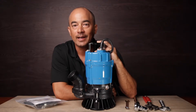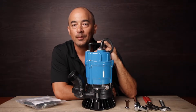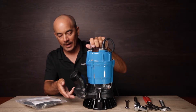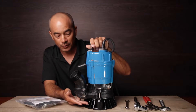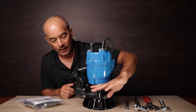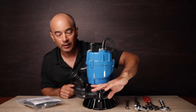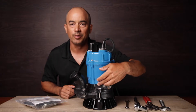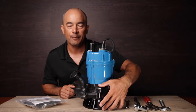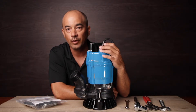The residue kit is really important because a lot of you want to pump down to a very low water level. As you can see with the HS2.4S, we've got this intake filter screen and the continuous water level for pumping — normally we want to be slightly above the impeller. So we're talking about this black line here, about four and a half inches, which is the continuous pumping water level for the HS2.4S.